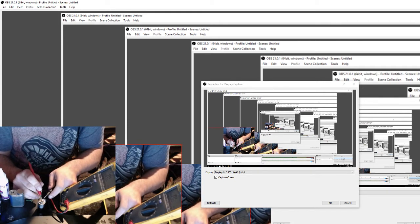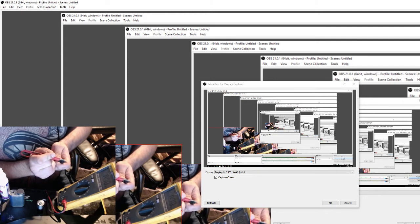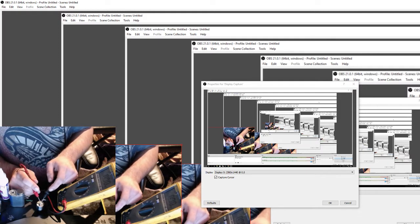Okay. Now, here's the RDA that I'm working with. The copper pin, as I said before, is going to be the positive pin. It is adjustable to fit a wide variety of devices. It's a very good feature and a must-have for anyone interested in going unregulated at all. So, being that that's the positive pin, this red tester will touch very simply over here. And before I do that, I have to obviously turn on the multimeter. I turned it on to ohms. It's signified by the omega sign. That is the SI symbol for the ohm, the unit of electrical resistance.